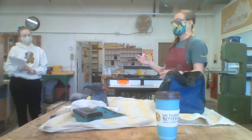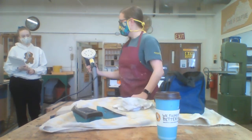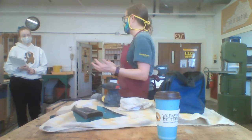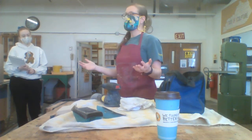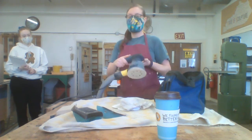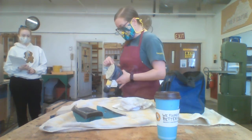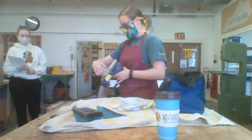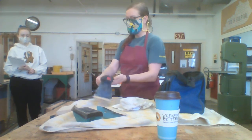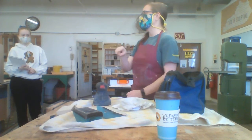To that end, it helps to have something that is essentially without direction when you're sanding. For that we use what's called a random orbital sander — that's what this guy is right here. It's called that because it spins in two directions: it spins this way, but it also spins this way. What it leaves behind as a result is a pattern of extremely tight little swirls.